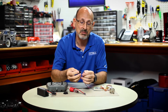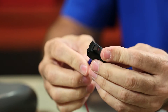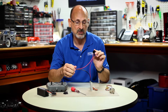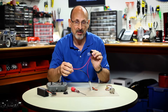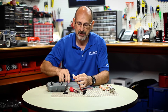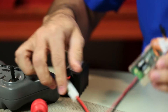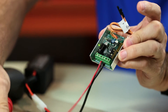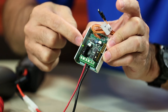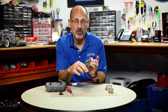I'm going to wire in my switch — I've got two spades, one side goes to one spade, the other to the other spade. You can see a little triangle switch interrupting the positive side; this is where my battery is going to connect. Once I connect the battery and turn my switch on, I should see a green power indicator on my Max RC motor controller, confirming we've got power.